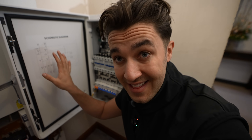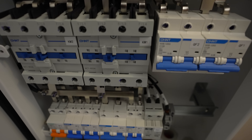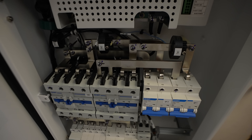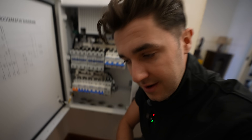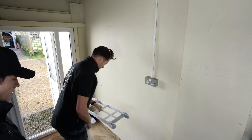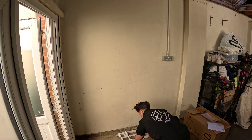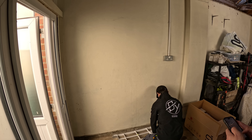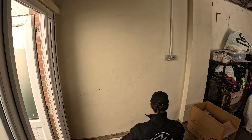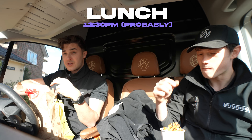As you can see, there is a whole array of contactors, switches, controls and breakers on this side, but we'll come to this later as we wire up every stage. First, let's start the battery on the other side. With the ATS on and mounted, we're cracking on with the battery storage side of things. The gateway is going to monitor the solar, monitor all of the house loads, and control the charging and discharging of that battery. So we have to start off with the base — but before we could do that, something more important crops up: it's lunchtime.